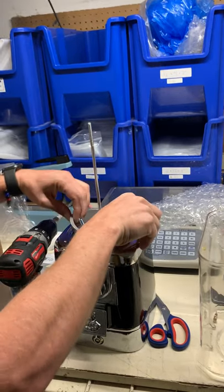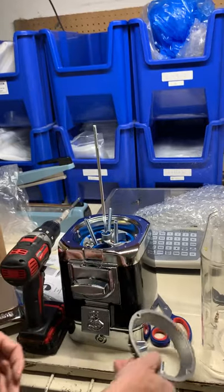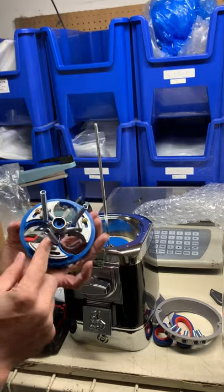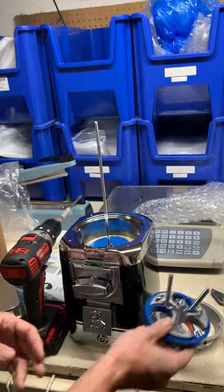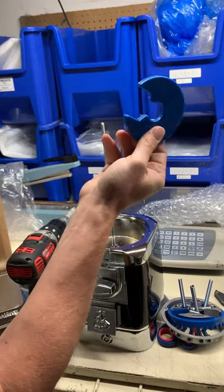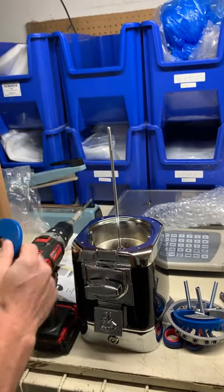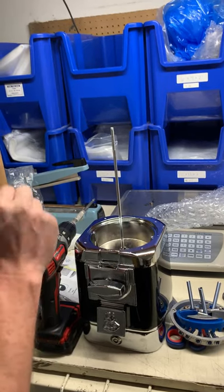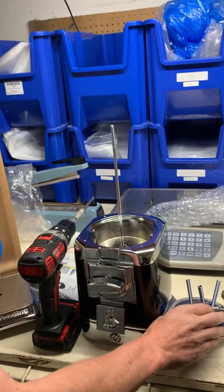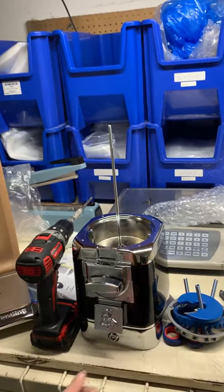The gumball wheel consists of three pieces: you have your brush plate, which has your springs, the wheel with the adjuster piece, and the riser plate. The riser plate is important — if you're doing an acorn capsule, you actually remove this piece; it gives a little extra space for the acorn capsule to fall in. So we use a gumball wheel for an acorn capsule with the riser removed.